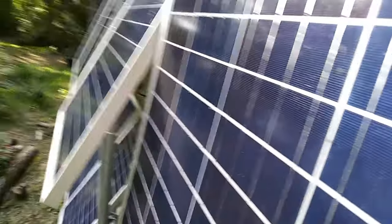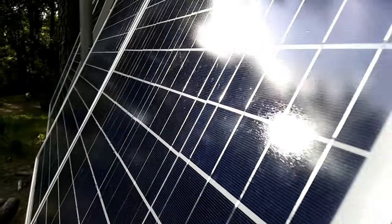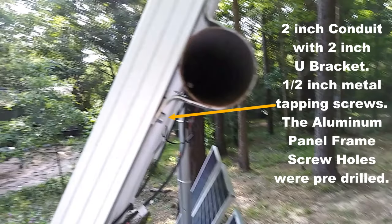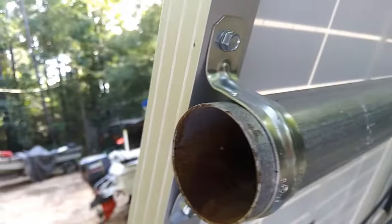The frame is what I was asked about. I used two-inch electrical conduit, galvanized, from Home Depot. All the mounts that you see — not the panels, but the mounts — came from there. What you're looking at is the very edge. These are 10-foot sections; that's how it comes, two-inch conduit. Then you've got a U-bracket, and we pre-drilled the little holes there. These are half-inch self-tapping screws.